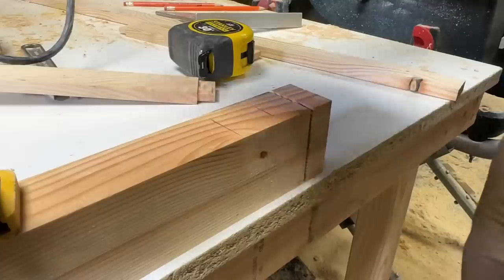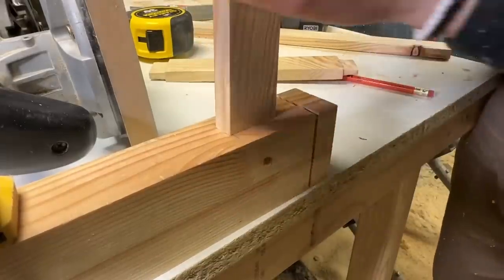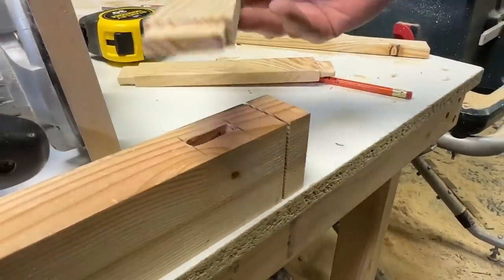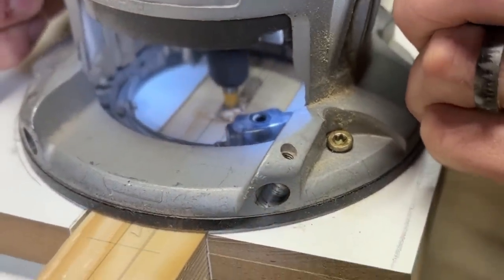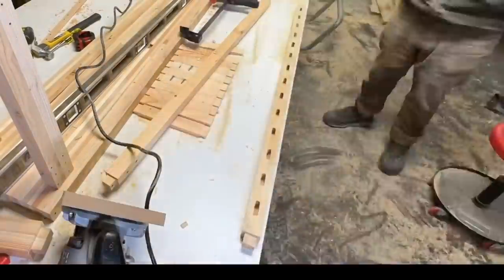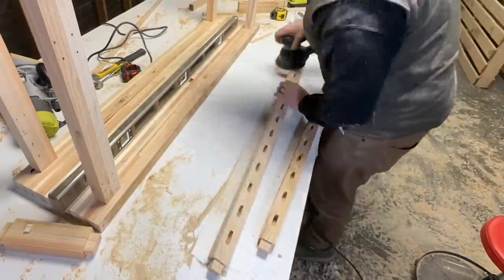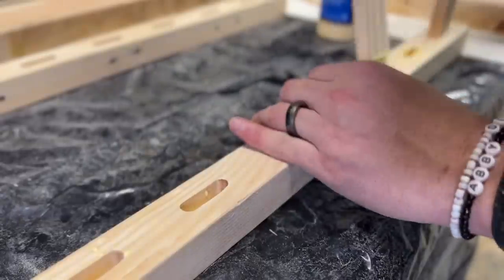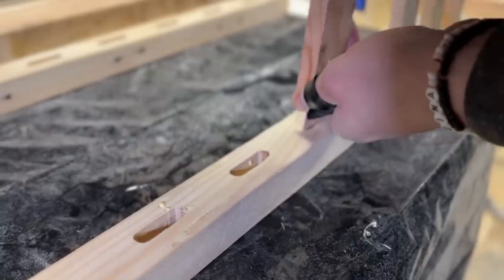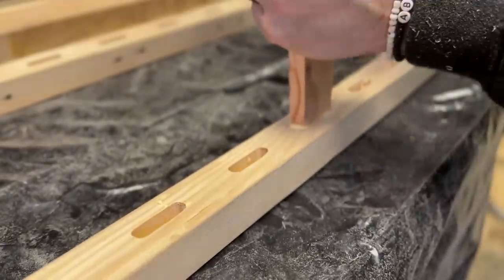Now I have my router here with a few pieces of wood attached to the base plate as a guide. First I'll mortise out a hole in a test piece just to make sure my guides are placed correctly, and my piece fits. So now I'm going to go on to my final pieces and route out all the holes. Since this will be very hard to sand once assembled, I go ahead and quickly sand these pieces with my orbital sander. Then I add glue and start putting these little slats in all the holes. I'm sure somebody's going to comment on the square peg in the round hole — when I chiseled out the corners in my test piece they didn't fit snugly enough, so I left the rounded corners so they fit nice and snugly with plenty of wood-on-wood contact.